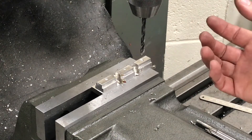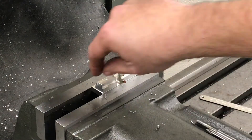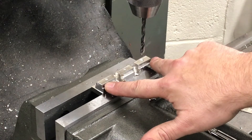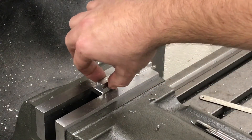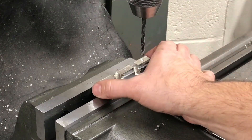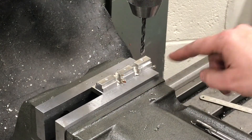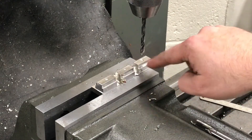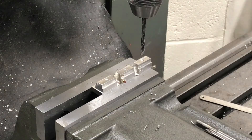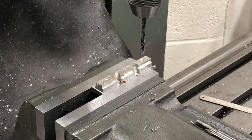It's an oversized piece of material. What I've done is milled the tenon across the full length, and then once I've got the right width on the T-nut profile, I've milled them to width and milled in here with an 8mm end mill. At the moment I'm just about to drill and tap these three holes, and then there'll be another operation after this where I'll flip this over and mill across the top, taking it down to thickness — and then these will be individual pieces. So I don't need to get the hacksaw out.